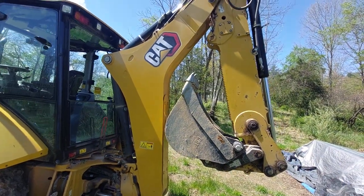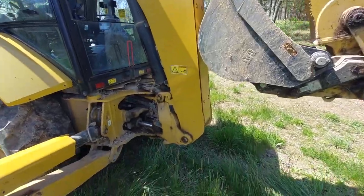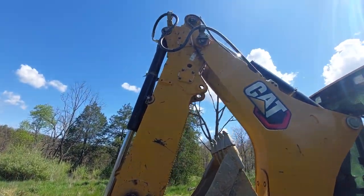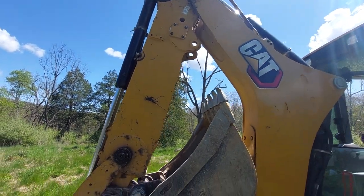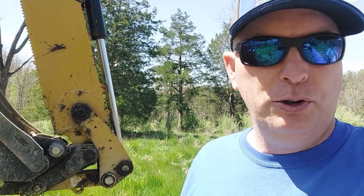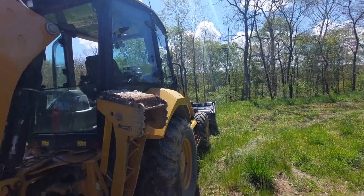The extendable hoe works great — I like it. It's got shims you can take out and you don't have to grease it. But when I first got it, that thing screeched and made all kinds of noise running it in and out. Somebody standing outside the machine had to plug their ears. What I've done is spray it with PB Blaster or Liquid Wrench — some kind of silicone lubricant. That changed everything; now it doesn't make a sound at all. That's a little hack trick if you haven't done that. I also like that the CAT keeps their hoses tucked at the same level as the boom.